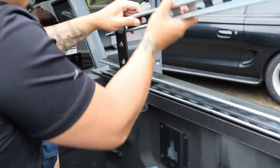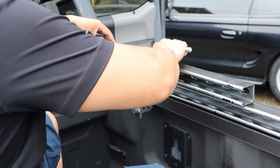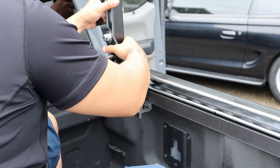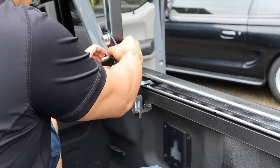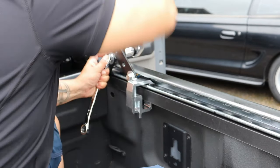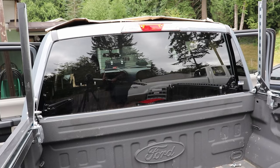Now, what's cool with these cone nuts is that you can actually slide them along the Unistrut. Right here, I am setting up the leg support where I want it. Now, on my right hand, I am putting through the 3-inch bolt with a washer on the other side, and then with my left hand I put in that 2-hole bracket, and then that's a washer, and that is the nylon nut. Now again, do not tighten it all the way, you're gonna be finagling it still,